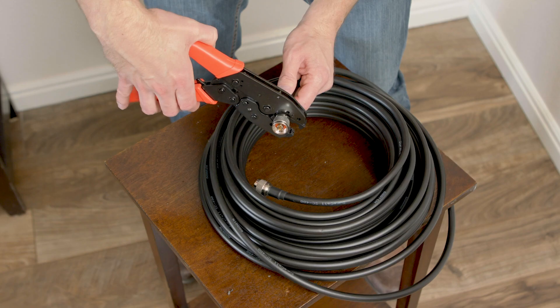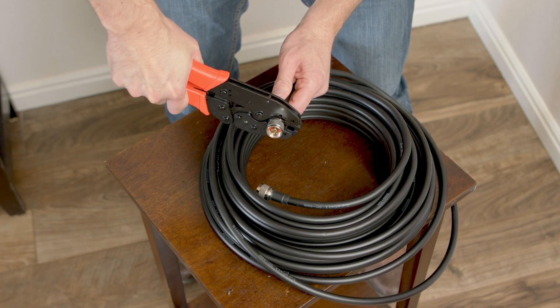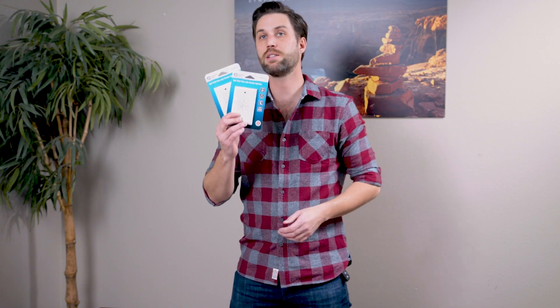There are also several other tools that you're going to need as an installer — not everything is included in the box. As a successful installer, you should have a signal meter (if you've got a demo kit you'll already have one), crimping and stripping tools for each type of cable, a cordless drill with a bit at least long enough to reach halfway through the wall, quality masking or painter's tape, and some indoor or outdoor plates for covering your entry and exit points. Having additional products on hand ensures a successful installation on the first trip.